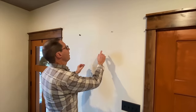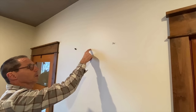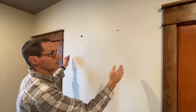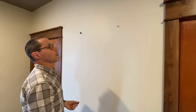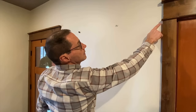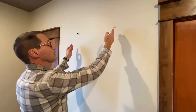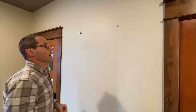The first thing you need to decide is how you're going to fasten it. In my case, I decided to put two screws into the wall. A lot of people go with just one screw, but that is harder to get the picture perfectly level. Two screws is easier to get it level, but you have to consider the spacing if you want to divide the opening perfectly. I used a stud finder and found where the stud is, so I put the first screw in that stud. The second screw has no stud at that location, so I measured over the exact distance from the door frame and placed that screw the exact same distance from the other side, so the picture is properly centered.